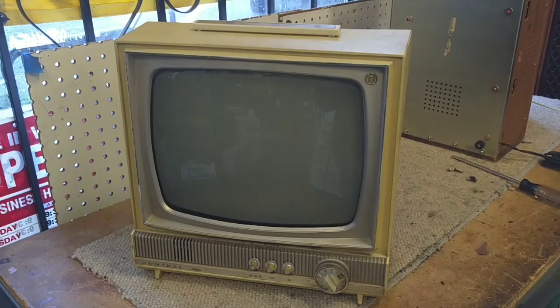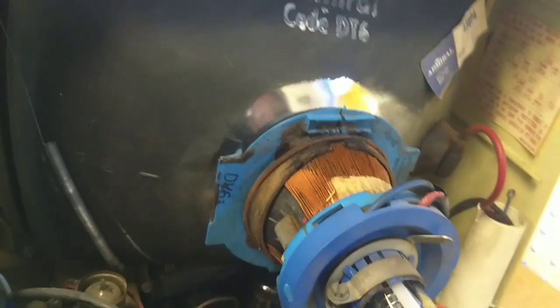Hey YouTube, JP Dillon. We're going to see if this is a part 3 of the PK-1369. Shango brought to my attention that there should be additional magnets here, and it's true that this top one here looks like there used to be glue there, although the bottom one didn't look like there used to be anything — no signs of glue. I have my pincushion magnets on the side, so I'm wondering if there was a correctional magnet here.